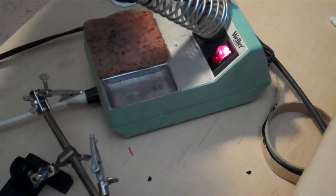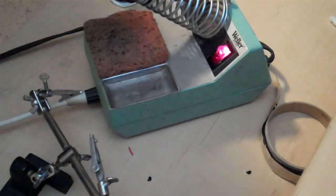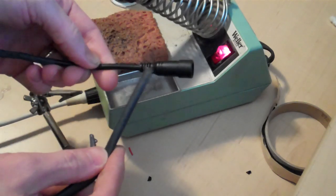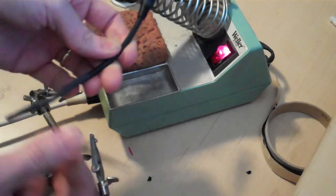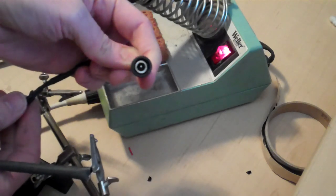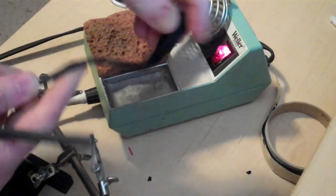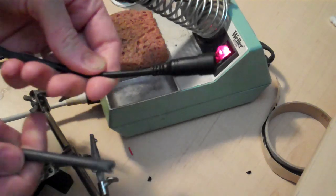Okay, this is just a quick unedited video on how to perform a splice on the Magicshine cables. The problem is right in here where you have a solder joint between the positive conductor and the center conductor on the cable. They can occasionally not be a good joint, and over time they break and then the wires toast, so you got to replace that connector.